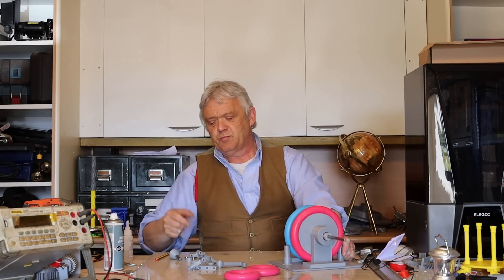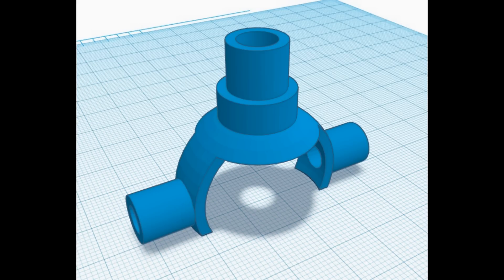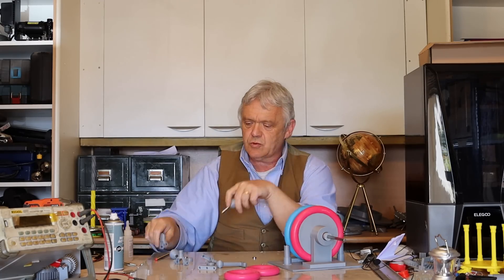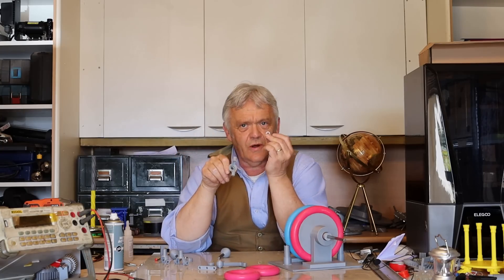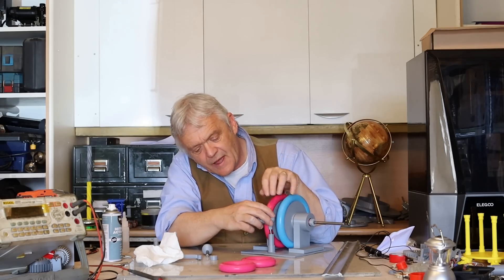I was going to use a dog's ball, but instead I printed this with an 8 millimeter hole. You can see I put a bit of 8 millimeter bar in there, because that sits in that housing. The housing allows it to spin in that direction, but we need a bearing in there. That bearing is 12 millimeters by 8 millimeters by 4 millimeters and slots in there. That's the ball unit together — it's got a bit of 6mm pin in there, a block on the end to stop the ball coming out, and the ball slots in there.